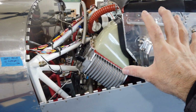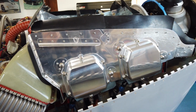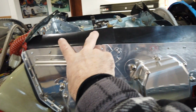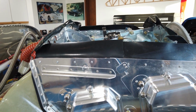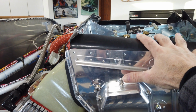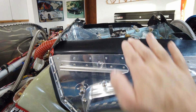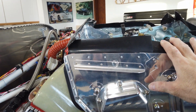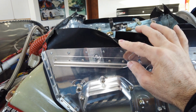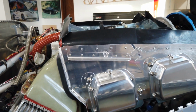The big thing, of course, has been the RTV sealing, getting these rubber pieces to work correctly. You'll note that these are cut up into multiple sections. There's a piece here of rubber, a piece here, a piece here. It's not ideal, but it helps alleviate gaps and bulges. When the top cowling is on, you'll get some areas that potentially bow, and of course the air can bleed through there. So to help alleviate that, I did these in sections. They overlap quite a bit, about 1.5 inches of overlap. That's probably overkill, but we'll see how things actually work when the plane is up and flying.